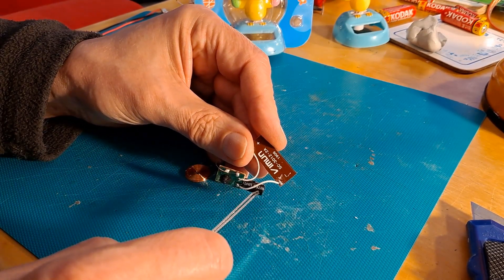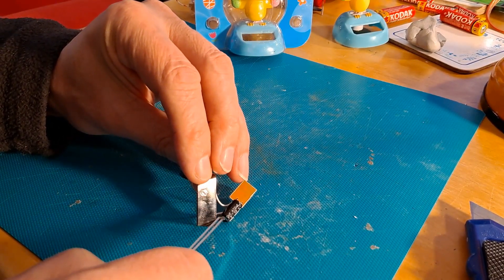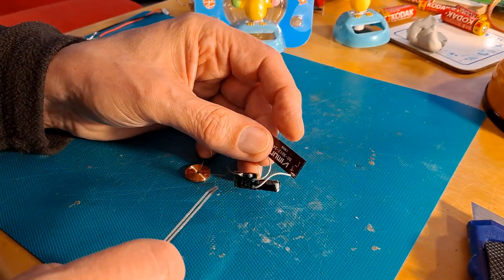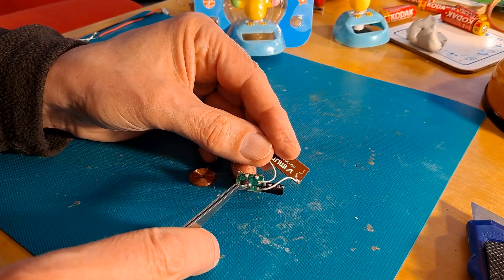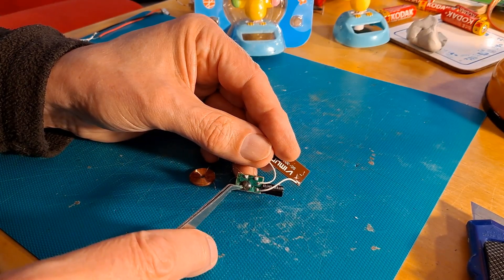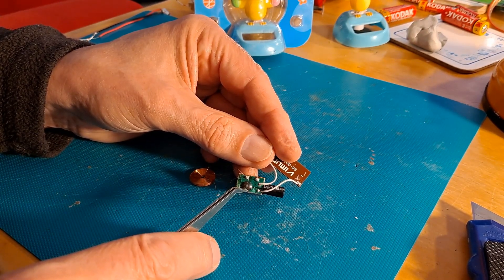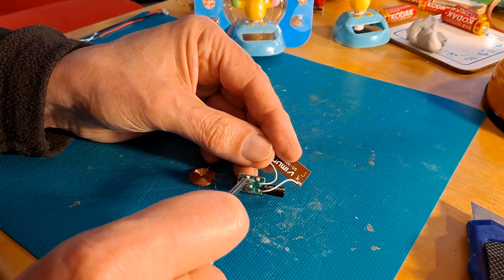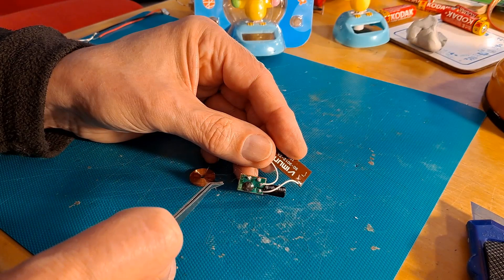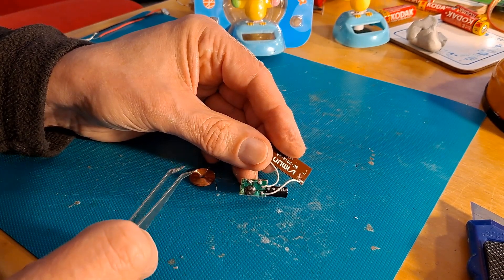I've never had one of those capacitors go faulty. It is the only bit of the circuit that can actually be de-soldered and re-soldered, but I've never had one go faulty. You can't do anything to that black blob — if you peel the black off it, it's not going to show you a multitude of little components you can replace. So if that's damaged, you're out of luck. It's possible, though I can't imagine how, that the whole circuit board may be cracked — if it dropped and you stood on it, you got a crack right across it. It's vaguely possible you might be able to get solder on either side of the crack and repair it, but I've never had that happen.